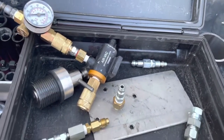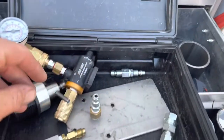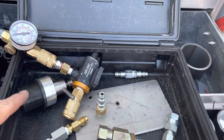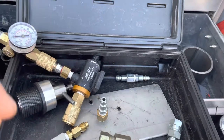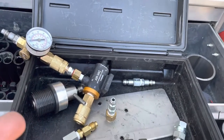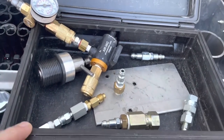One thing to notice is that on John Deere wheel loaders, for example, you can't just put this in the tank fill because there's a breather. You have to either plug the breather, or that's why I use the breather attachment — you take the breather off and this goes in the breather port. Because if there's a vent for the hydraulic tank, it won't pull a suction.